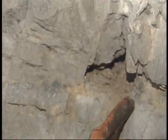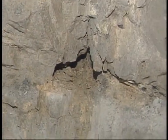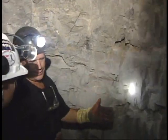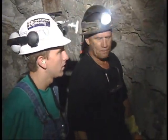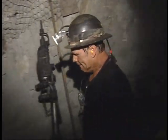You should never collar when you're drilling your round. Like this hole here, say your line comes down, you should either drill a foot above or a foot below. If the hole's like 6 inches deep, and you're a foot above or a foot below, you can't ever hit it. All right. That's basically it. Now we better get our hoses.